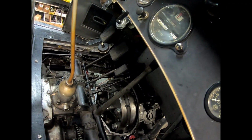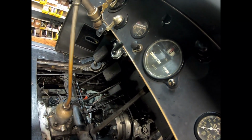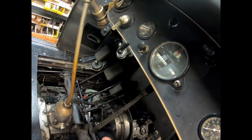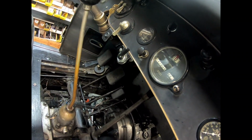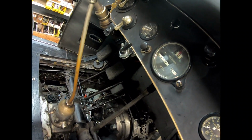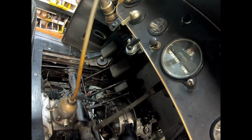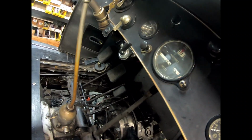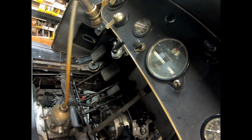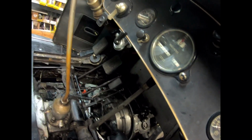And also, I had started my last video, I already had the springs and spring caps in place. And you also see under here about an 1/8 inch thick spacer. Those spacers are typically removed to allow more spring pressure as the clutch wears, and to give you a little bit of grip to give you a few more miles on the road with the old clutch linings and center plate. So a lot of times when I redo a clutch, these are missing, so I need to make new ones and install them, which I had to do in this case.